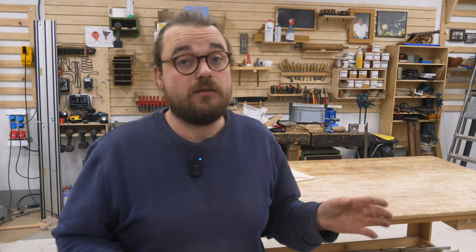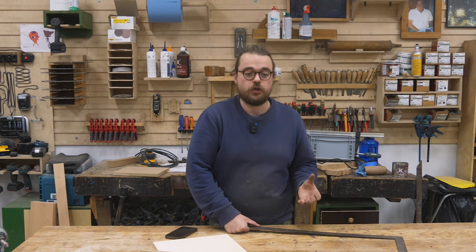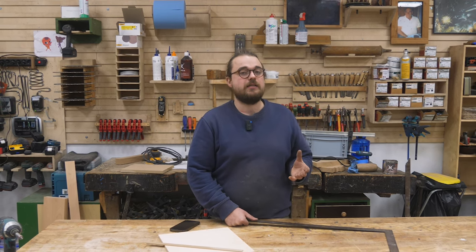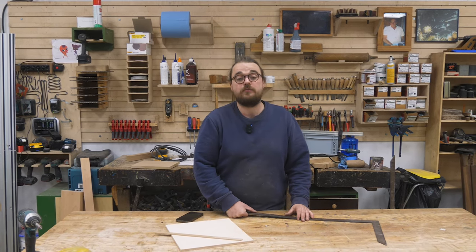In the last video I mentioned that machines like this are heavy, but there are ways of moving them. At around 200 kg, 4 people can carry it — easy. You could do it with 3 people, but then it gets a bit trickier. If you put straps around it with 3 or 4 people, it's definitely possible. I'm not saying this theoretically — I've done something like that before. If you want to put a machine like that in your basement, you could remove the cross slide at the front, remove the motor, and there's less risk of essential components breaking if it tips slightly.